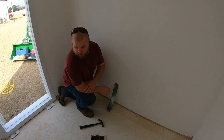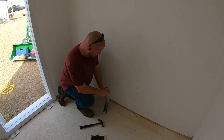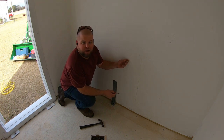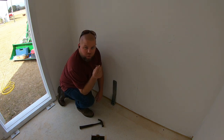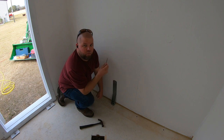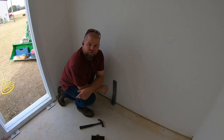Here comes the back-breaking part that I truly am dreading. All 16 of these straps have about 20 nail holes in them, so I've got a lot of nails to drive in bending over — I'm about to take lots of breaks. The plans specify a specific type of nail — these are over three inches long. Technically the plywood acts as a hurricane strap the way it's strategically nailed top, bottom, and all throughout the timbers, holding them together. So a nail that just goes into the plywood would be quite strong, but these are going to go well through the plywood all the way into the timbers on the inside — that solid wall really holding this thing. You've also got shear strength in the lateral direction, so if something were to impact the wall you've got all these bolts protecting you.